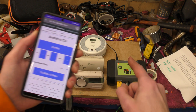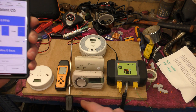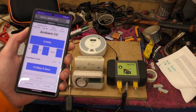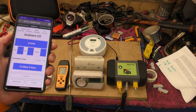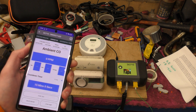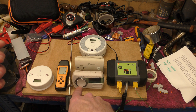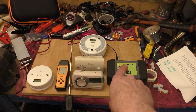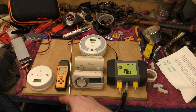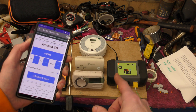The DC710 is running and we currently have no parts per million, which matches everything else at the moment. For my carbon monoxide source, I'm going to run a petrol generator indoors - like you should never ever do. I'll take my wireless and go outside, and unfortunately you have to stay here in the carbon monoxide, and we'll film which one of these gets set off first - or never - and then we'll be able to do a comparison. I'll be able to see when the carbon monoxide is high enough that it should be a problem.